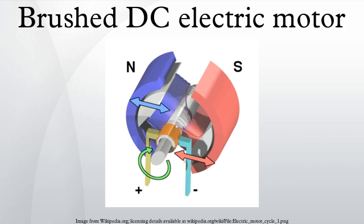The shunt field windings of both DC machines are independently excited through variable resistors. Extremely good speed control from standstill to full speed, and consistent torque, can be obtained by varying the generator and/or motor field current. This method of control was the de facto method from its development until it was superseded by solid-state thyristor systems. It found service in almost any environment where good speed control was required, from passenger lifts through to large mine pit head winding gear and even industrial process machinery and electric cranes.